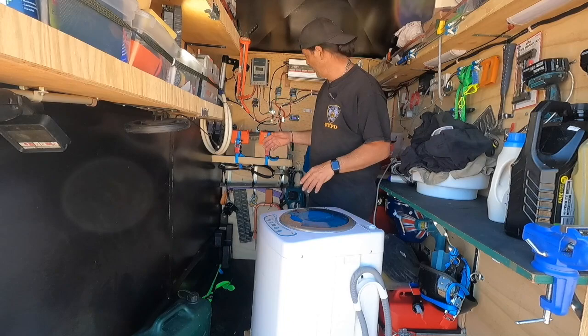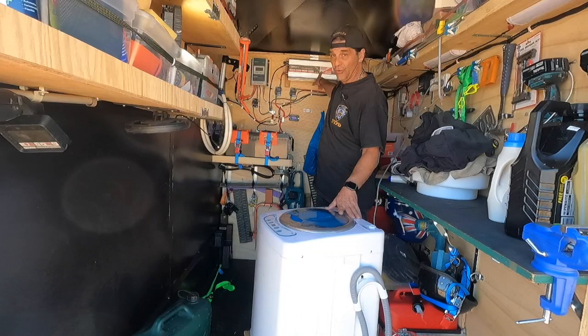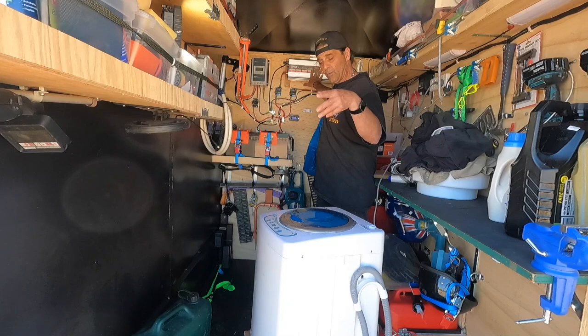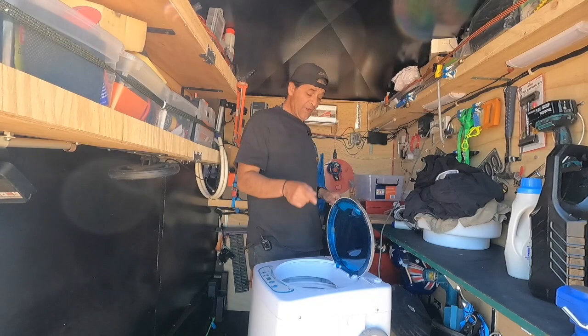You must have power in your setup — a big battery, solar panel unit. 2,000 to 4,000 peak watt inverter. You can get a smaller one — I've just gone overkill just in case. It's all joined up to power here, all connected. When this is running, motors take a lot of amperage — this actually takes 10 amps to run, which I've been watching on my solar monitor.